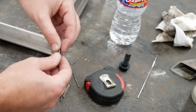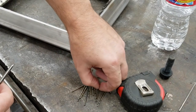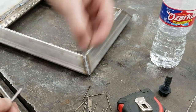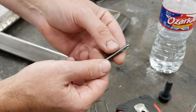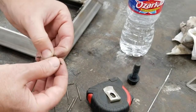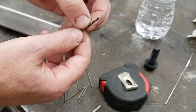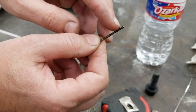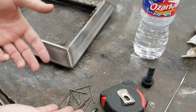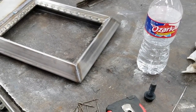The other thing I wanted to show you is, when I bid this project I budgeted all this in, and I think there's about 14 of these — these are cobalt stub-length drill bits, a number 51 and a number 47, 60-thousandths and 70-thousandths respectively. The lower holes and the upper holes get the different ones. This is a Keo brand carbide center drill, which I've had really good luck with, and you can see I broke both of the tips on that. Every one of these drills got broke — you can see that one's broken off. A couple of times one got work-hardened; you can see the end of it is kind of rolled over there. So that was the carnage — about $60 worth of drill bits. But this is a fairly sizable project, so overall in the scope of the project, no big deal. Anyway guys, hope you enjoyed it and we'll see you on the next video.